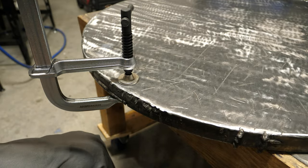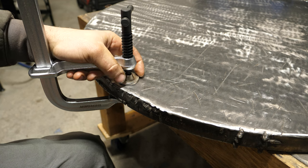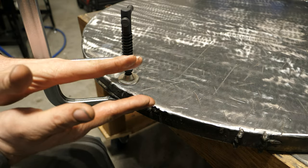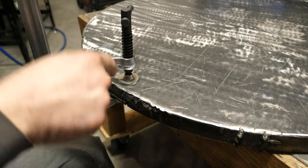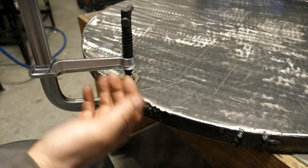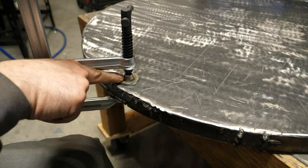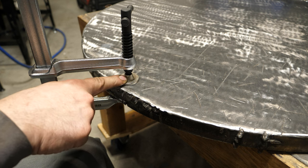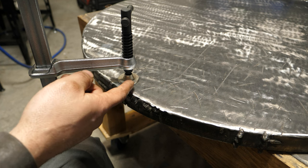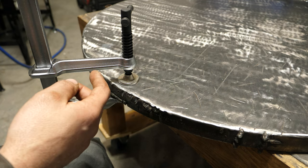About there I could spin this a whole other turn, but this is what I'd consider normal average clamping pressure on this clamp. Under load the arms are parallel, but under a lighter load the screw is essentially pointing back because the jaws aren't parallel, which makes it worse for clamping oddball objects — they're going to want to pop off. And this pivot here, once you use it enough, doesn't pivot that well. It's not a flawed design for $20, but there are limitations.